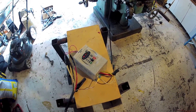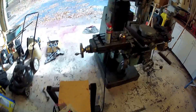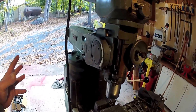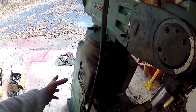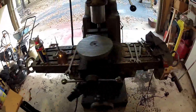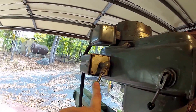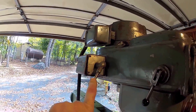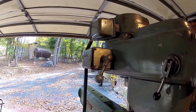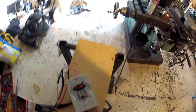This mess of wires is completely temporary, and it was really just to validate that this device is going to work with this machine. Now that I've done that, I'm going to move towards a permanent application — I'll probably build this into either a ram-mounted or side-mounted control box or electrical equipment enclosure. I'll eventually put remote controls either down here or possibly where the original reversing lever was. These older Cutler-Hammer or other machinery control manufacturers that built this stuff from the 1930s on will probably be replaced entirely by either remote control buttons or possibly this box. I feel the desire to enclose a lot of this in one big safe container.